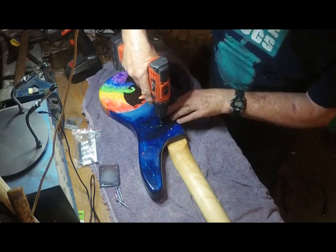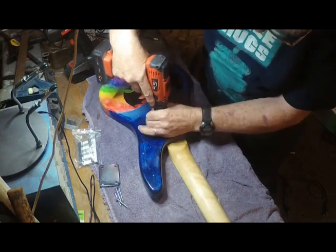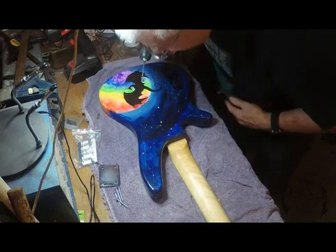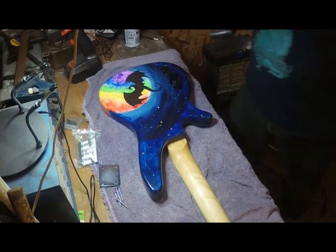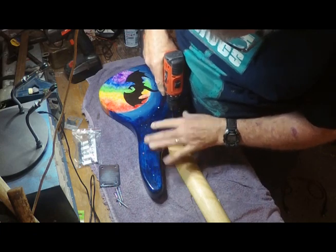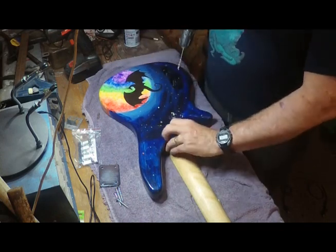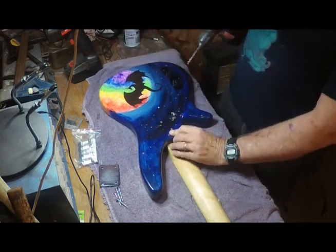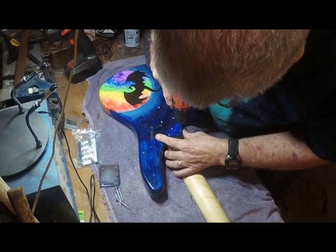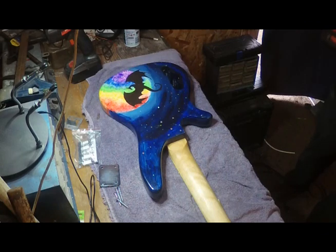My drill made short work of that, so that was no big deal. This particular drill, I have a little trouble with the chuck and every so often the bit likes to try to come loose, so I may end up getting another one sometime soon. I generally only drill these holes maybe a quarter of an inch deep. The instructions say don't drill too deep for obvious reasons, but I found I don't need to go especially deep at all - just enough to give the screw a little bite into the wood. The less of the wood I drill out, the more the screw has to hang on to.